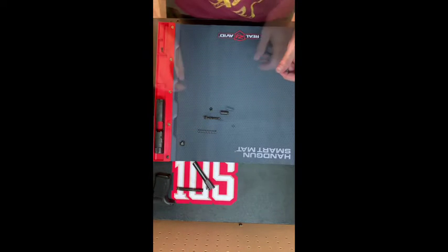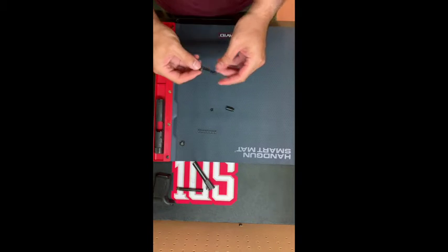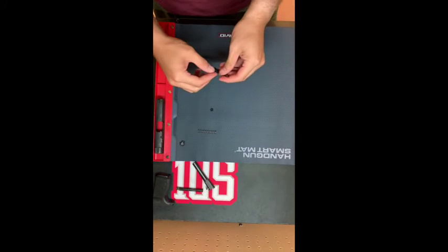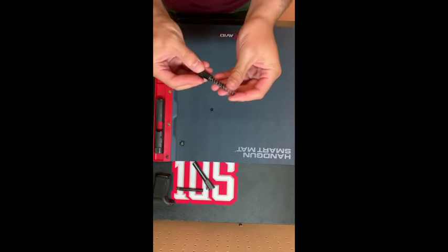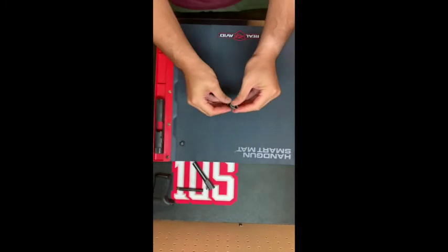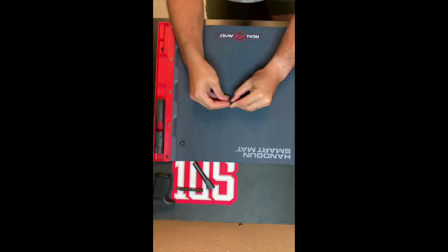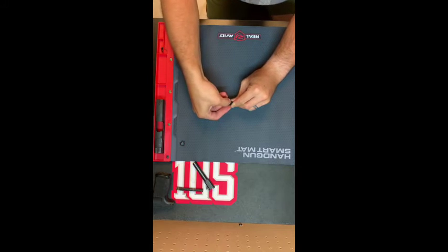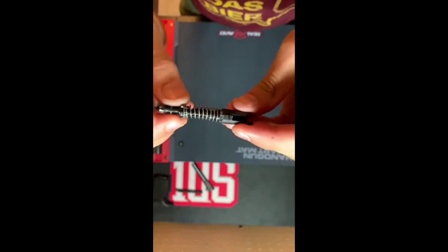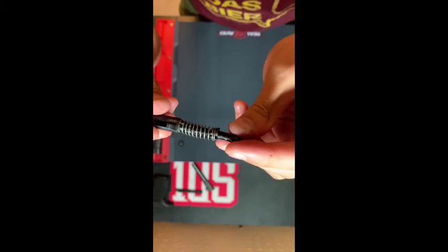While we're here I'm just going to give it a little rinse. So we don't have a bunch of little parts throughout this whole project, we're going to reassemble the striker assembly now. That's the sleeve spring, then the sleeve goes over the top of that, then the striker spring — push it all the way down to this point so that cap will fit back on. These used to come in two pieces and now it's a single piece, which made it a little bit harder to get everything lined up. But that's the striker reassembled.